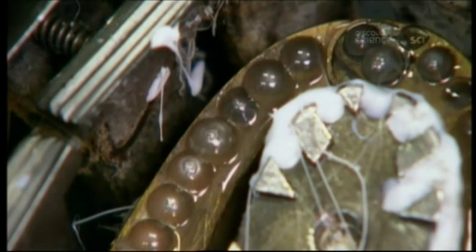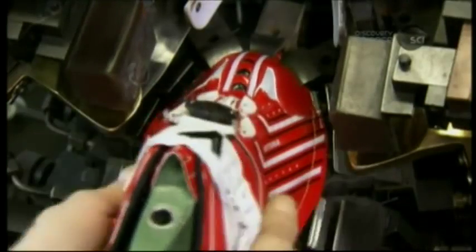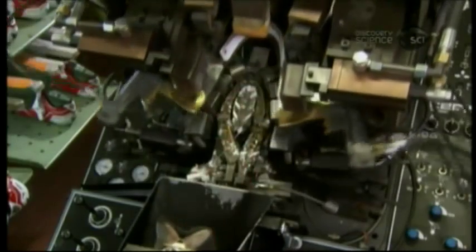Then it's over to a machine that oozes epoxy — a high-strength glue that is impervious to weather extremes. The machine grips and folds the cycling shoe upper to the sole as it applies epoxy to seal them together. The epoxy hardens quickly and a computer-controlled grinder gets rid of the excess.